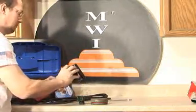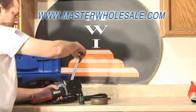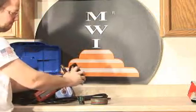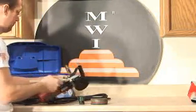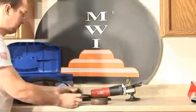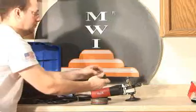Pick up the grinder and attach the 4-inch Velcro pad holder. Attach the wrench and hand tighten. Pick up and attach the hose connection to the wet feed grinder. Note, this connector will allow you to attach to any garden hose.